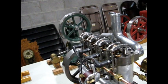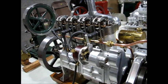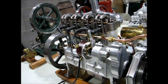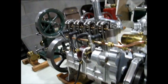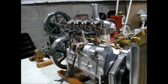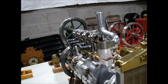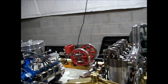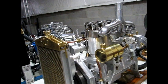The next engine is a Holt Caterpillar 75 horsepower engine. It was built from the drawings that Holt used to sell. I didn't care for the way it was built and heard some poor remarks about the castings, so I scratch built mine. I bought the large flywheel and the intake and exhaust manifolds as castings. It has a splash oil system, a set of points to trigger the electronic ignition, a one-inch bore, an inch-and-a-quarter stroke. It's water cooled and runs on regular gasoline.